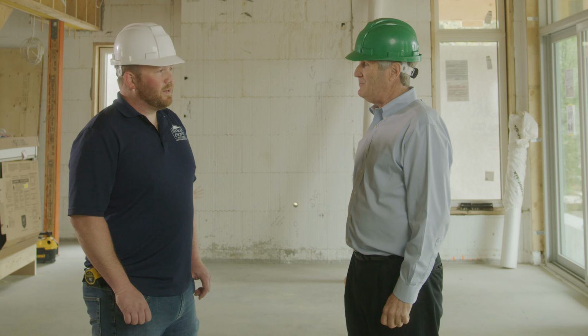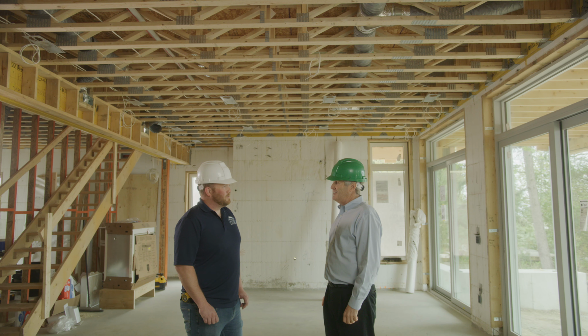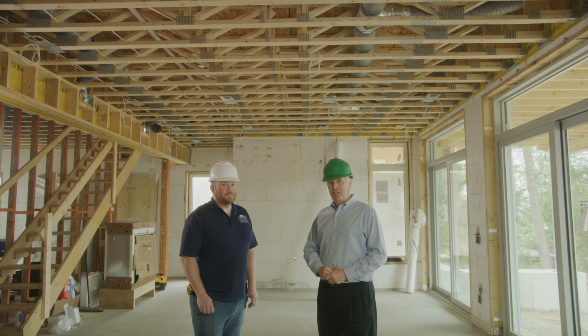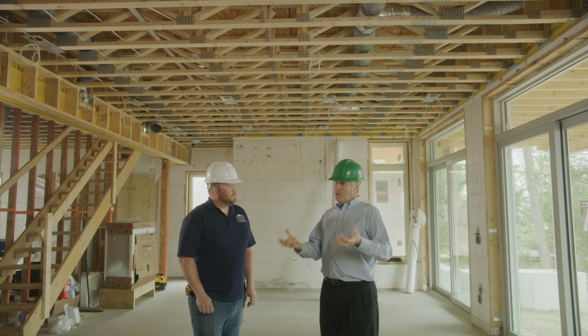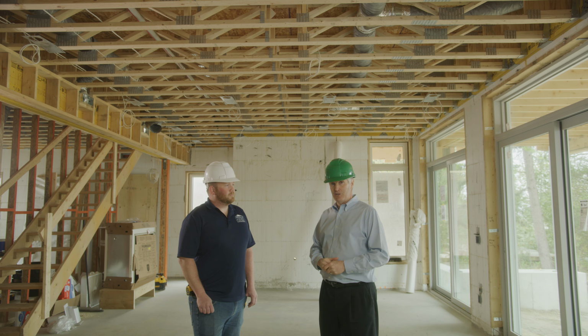Yeah, it saved a lot of time in the back framing, and like you mentioned, you don't end up with bulkheads that nobody really wants to see. Very cool. So I'm excited to show you that as a mechanical guy looking at different ducting options. This marries up really well with that Fujitsu air handler I spoke of. And in fact, the system will be zoned. I've got it designed such that one trunk serves the main floor and a second trunk serves the upper floors, so that we can actually use zoning in heating and cooling mode.